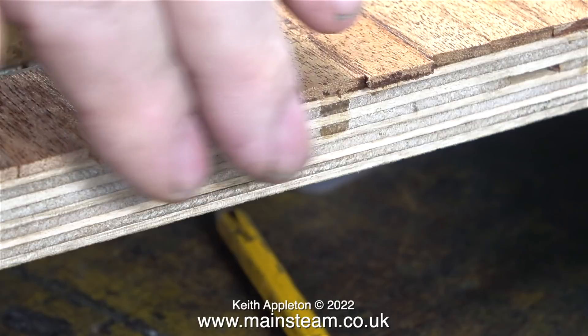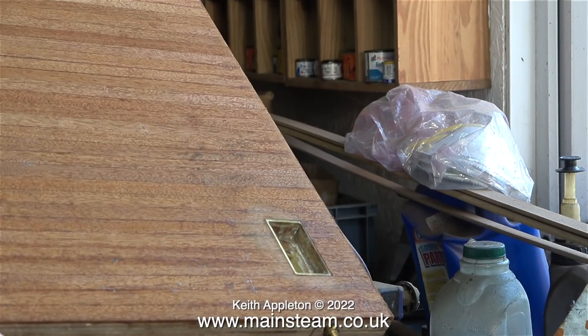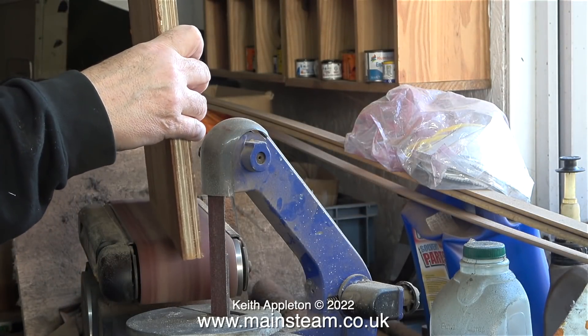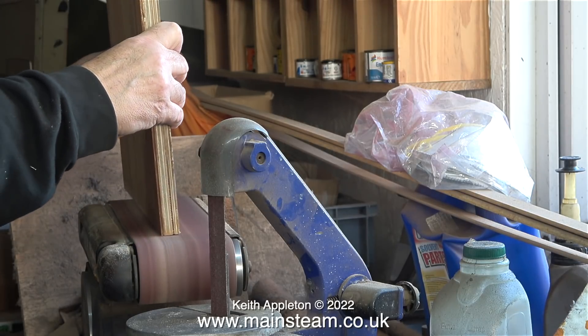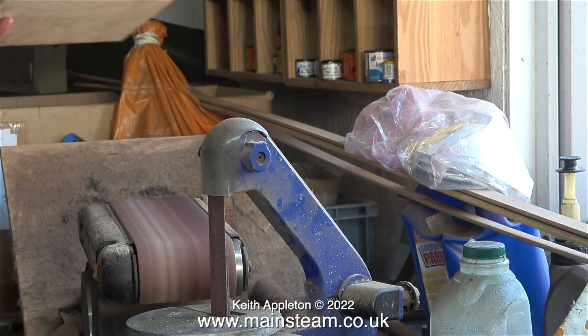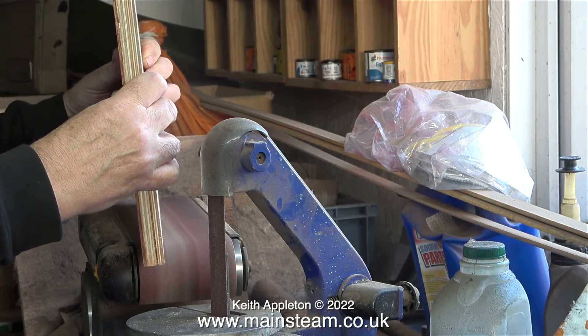Leaving the bricks for a while, it's time to have a look at the edge of the baseboard — every one of these planks overlaps the baseboard, which was intentional. Here's a shot of the top of the baseboard showing the drainage sump fitted. I need to do quite a lot of work on these planks: they all need rubbing down with an electric sander. I would normally use an orbital sander for this, not a belt sander — that would be far too violent and make a mess of the mahogany — but for trimming the edges, my belt sander in the outer part of the workshop is ideal. Please note I am not holding this vertical on purpose; the mahogany is much harder than the ply, so the idea is to trim the mahogany first.